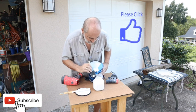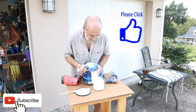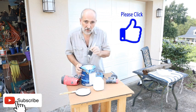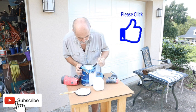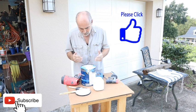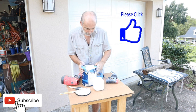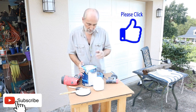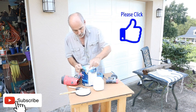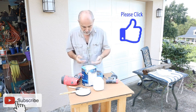That worked pretty much as I expected, but every once in a while I pour too quickly and still cause a mess. So that's one thing that's good about making YouTube videos. You're just a little bit more careful when you're on video and don't make as much of a mess. Also, by doing this, it keeps the rim nice and clean so you can get a good seal. With the metal cans, I would sometimes take a small brad and tap a small hole around the edge of the rim on the inside so that if I got any paint in there, it would drip through into the can of paint.